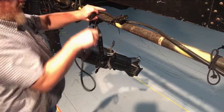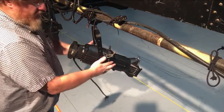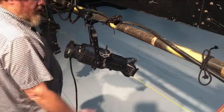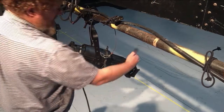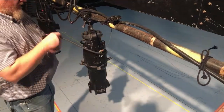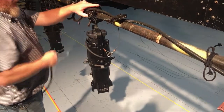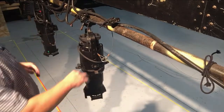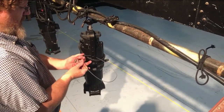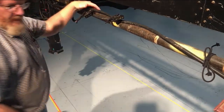The next one is the ellipsoidal — same process with a slight variation. Disconnect the power cable. Push all the shutters in so they're not sticking out and getting caught on other fixtures when you bring it down. Close the gel clip. Point it straight at the floor, loop the cable gently around once and hang it through. Then loosen the C-clamp bolt. Figure out where the fixture is going. Pull the safety cable out and put it back around the yoke. Loosen the C-clamp up generously, slip it off the pipe, and go put it where it goes.